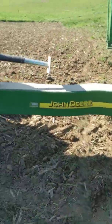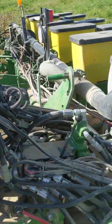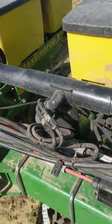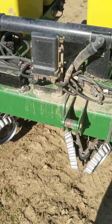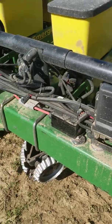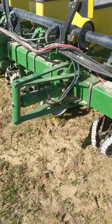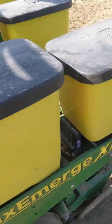The Graham system is tied into my AgLeader power box right here, and the system consists of these modules right here. They're attached by a magnet, powered by these blocks right here that control all the rows of the system. It talks to the controller, which is essentially a Samsung tablet in the cab, that communicates with these modules via a Bluetooth controller to tell it when to turn on and off the individual row controls, and it spits out power to the motors through these drives.